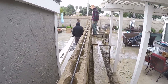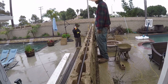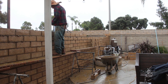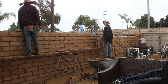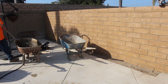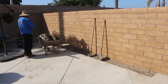What will happen now is you're going to get your second inspection — the pre-grout inspection. You had the foundation inspection; now you get the pre-grout inspection. The inspector will come by, look in all the cells, make sure the steel is centered, make sure it's at every 36 and at full depth. Once that gets signed off you're good to grout and cap, and then one more inspection — that's the final. The inspector can tell whether it's been grouted by tapping on the block, or sometimes you can still see moisture bleeding through the block from the cells that were grouted, depending on how soon they get there after it was grouted.